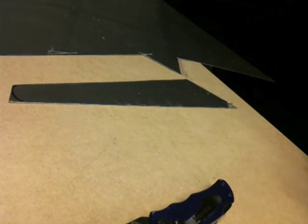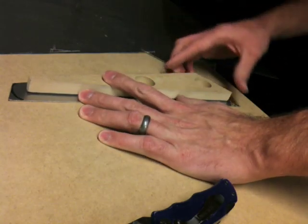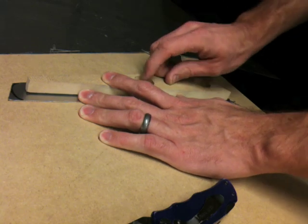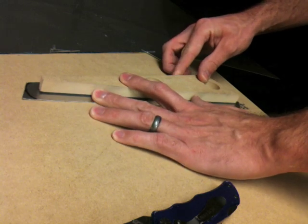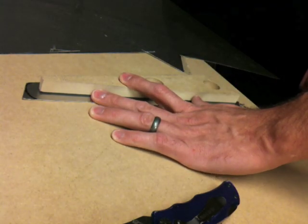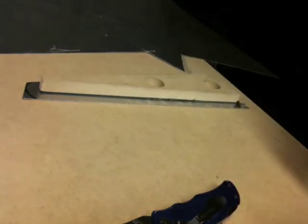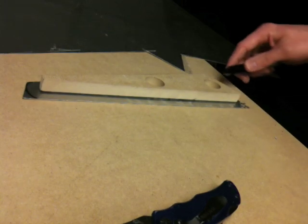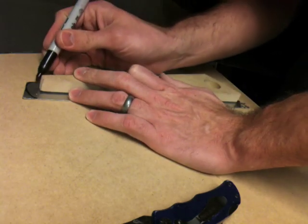I take my form block again and, looking at the work I've done, I can visually see where those center punch holes are and line my block back up. I'm going to go ahead and draw some of the lines — actually, I'll be drawing those lines when I punch the holes. The only lines I really need to draw out here are to show where the end of the flange needs to be.